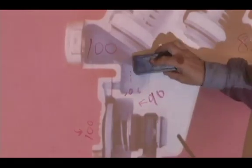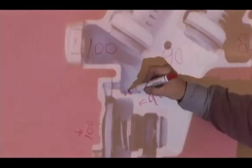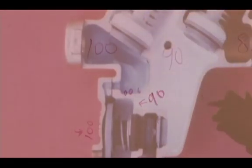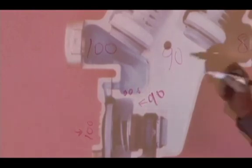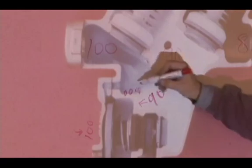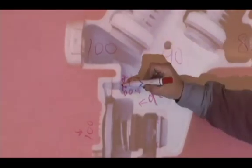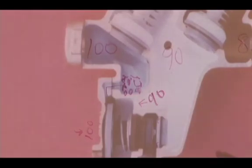And now, when the water resumes, this can no longer be sucked into the flow of that check assembly. Not a bad idea. Helps us out quite a bit if the dirt and debris is there just when the check assembly closes. But what does putting all this dirt and debris down here do to our relief valve now? What would happen if this whole area, we had a lot of dirt and debris built up? Could it plug my high pressure sensing line right there? Sure. Could that affect the interface between the high and low pressure sensing line?